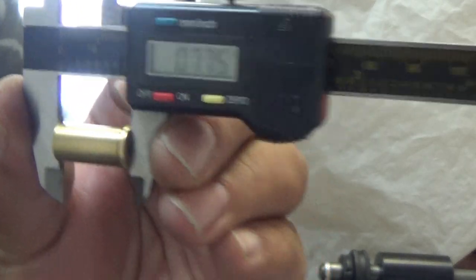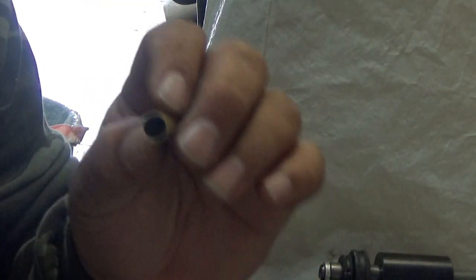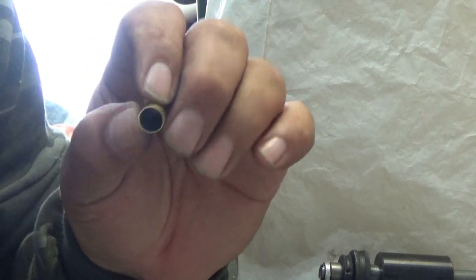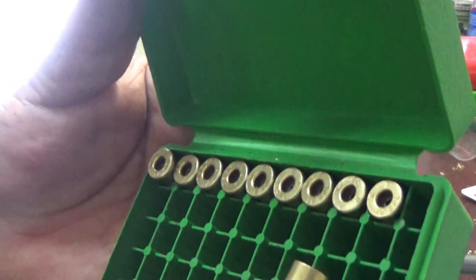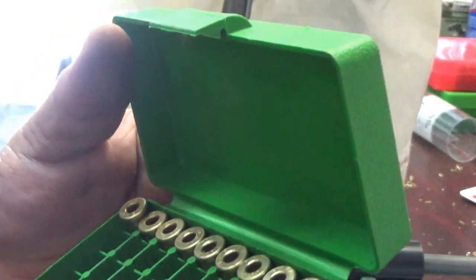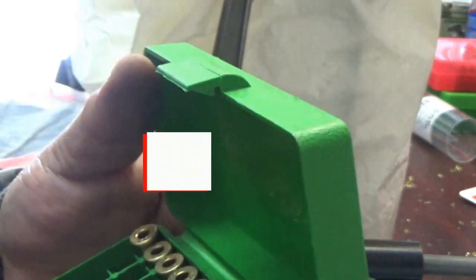.775 on the nose. Comparing the drill method and the hand method, the hand method gives me a little bit more precision, so I'm going to stick with the hand method. Right now we've got about 10 done and we're going to make another 40 more, all measured to .775.